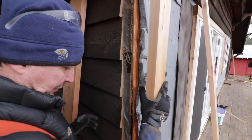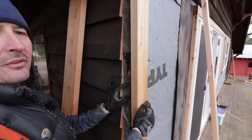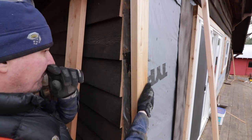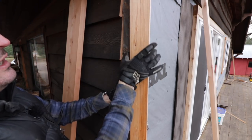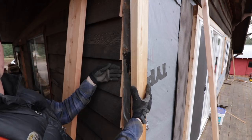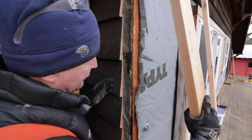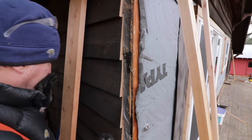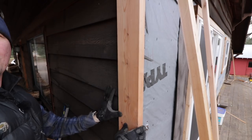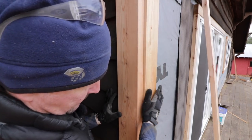My original thought was a trick my dad taught me — we've got this cedar, which is very impervious to rot in the Pacific Northwest, probably the hardest place on siding in the world. The idea was to take a 2x4 cedar, rip the bull noses off, lay it sideways and use it economically for both corners. But as soon as I cut it and put it on, that didn't work because there was nothing to nail to — the backing is way back in here. So I've got another piece, a 2x6 of cedar, which has to be a bigger corner so I have something to nail to. I'll toenail into the corner and put this piece here to make the corner like that.